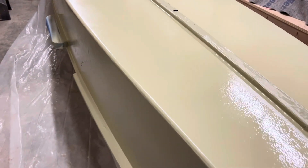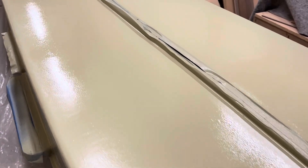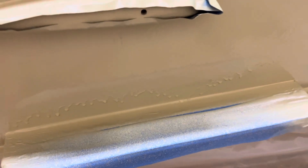The last time I used this paint I used the satin, not the gloss, and it's drying a lot slower than normal. I think I put too much paint on — on the sides it looks like it's dripping. Yeah, I'm going to have to let it completely dry overnight, then sand it, and put the top coat on. Yeah, there's dripping over there that looks awful. I've got to let it completely dry, sand it, and then put a light coat on tomorrow.